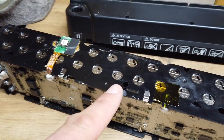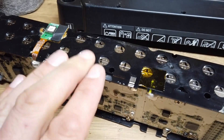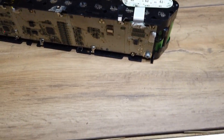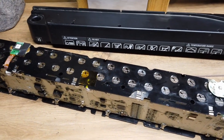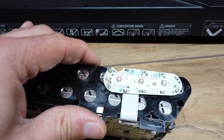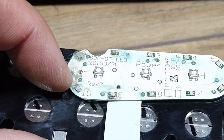Just be aware that these things hold a rather dangerous amount of power. You can see by the little flashing light down the bottom that this is still live and active, so even when you've got it out of the pack it's still dangerous — don't put it on anything metal. Make sure there are plenty of insulating surfaces for this to rest on. That's definitely looking a little bit corroded there — I think it's time to get some cotton buds out with some alcohol.